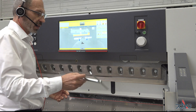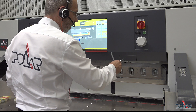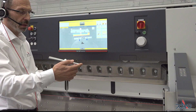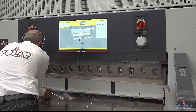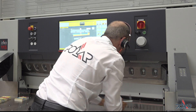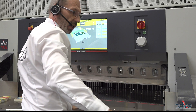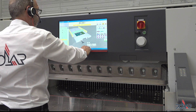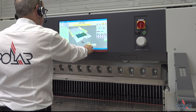Now there's a better tool available which every operator knows. This is the tool for bringing the knife a little bit more down for fine adjusting. The T-tool, with this side, fits exactly into these holes here — one after each other — and I'm done. Very easy and quick, I can take out my false clamp plate and now I can go full way forward.